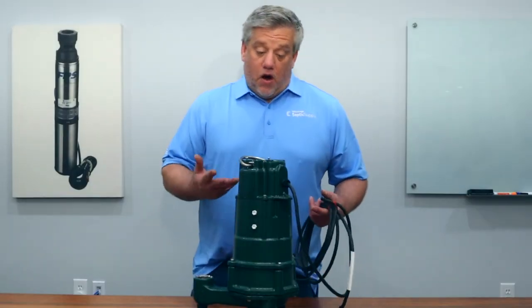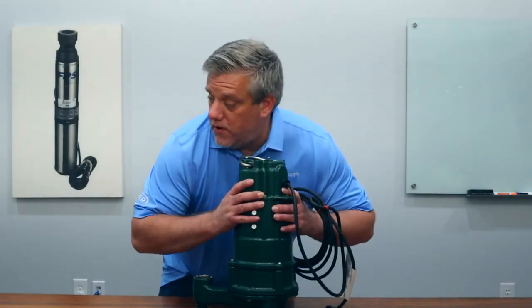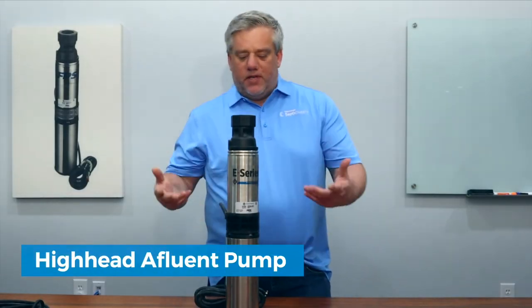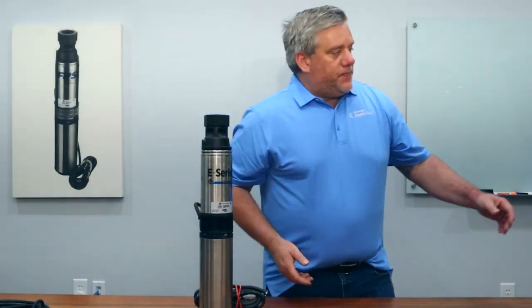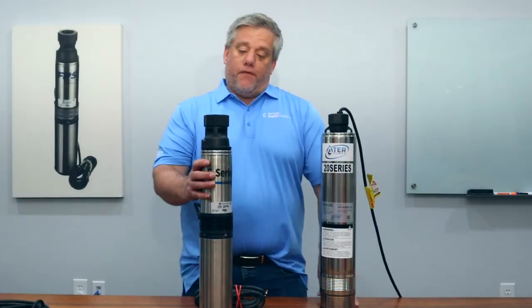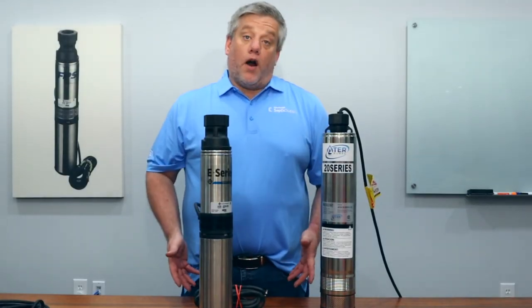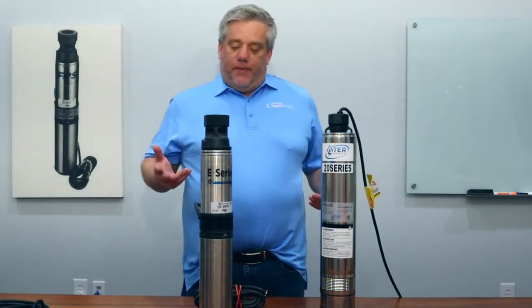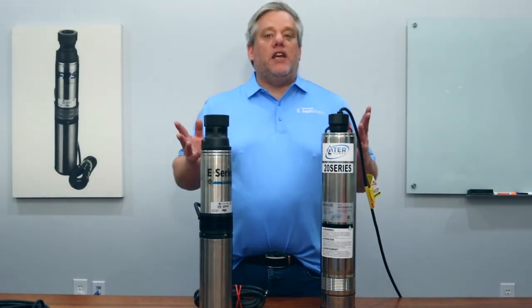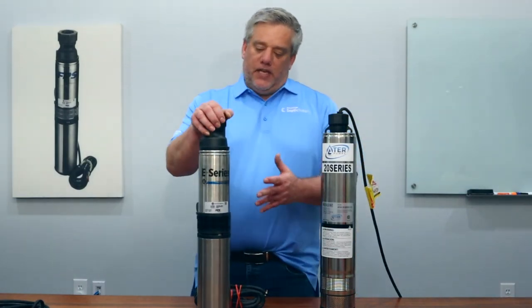This is a Zoeller one horsepower grinder — the Shark. It's a great pump. This here is what we call a high head effluent pump, also called a turbine pump or sprinkler pump. These pumps were initially designed for water well applications — they go down a four inch pipe, the pump is three inches in diameter, and they're lowered hundreds of feet to where the water is and pump it up. Septic people figured out that because many states use spray systems, these provide enough head pressure for a septic tank, the water is clean enough after treatment, and they last a long time.